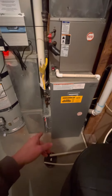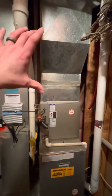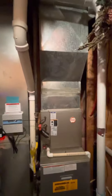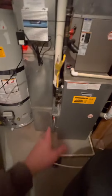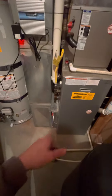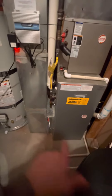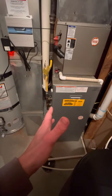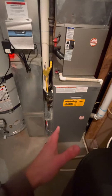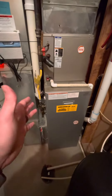We do have approval if we need to completely change this over. My typical thought is: base can, filter rack, furnace, AC coil, and then we'll probably have to condense it down a little bit at the main plenum stack. We'll probably do a new filter area, but the Pristine Air is right here and we want to keep it. Greg has approved swapping over to a 20 by 25 by one filter if that's easier — either way it will need to be on a base can being a four-ton, and that should free up quite a bit more space.